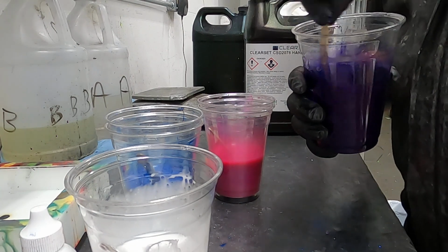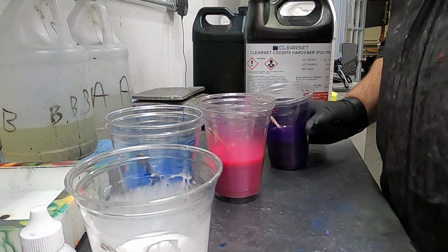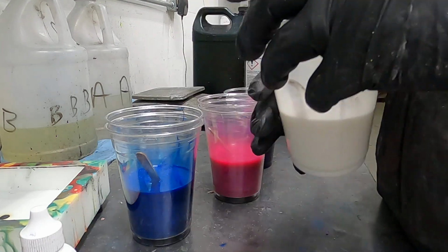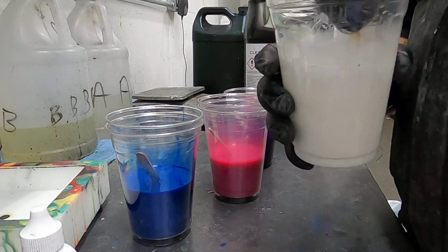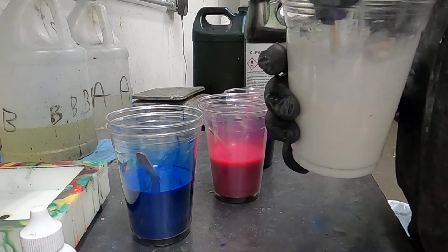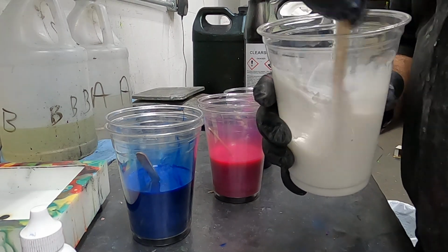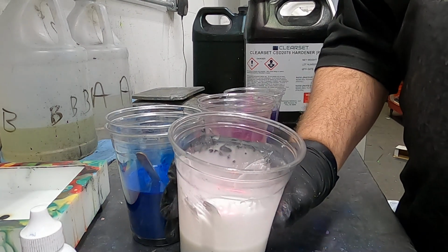We've got a desiccant filter in line. Highly recommend. You can get them pretty cheap. Those are the ones that you can put the little beads in. Just put them inline in your hose. That really does wonders for making sure you don't get too much moisture. Maybe you forgot to drain out your air compressor or something. That will catch that moisture before it makes it into the pot. Wouldn't say it's required, but it definitely makes a difference.